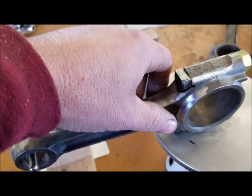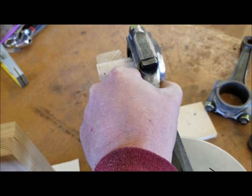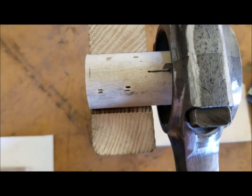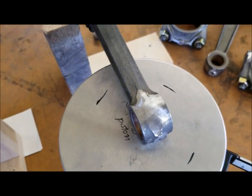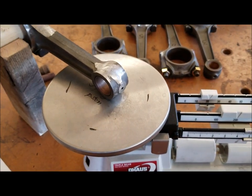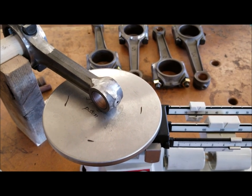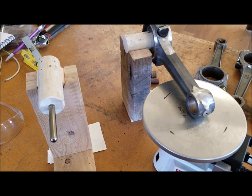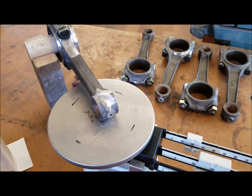When I go to switch this, I bring it over and get it to where it's pivoting just on the razor blade, then set it on the scale and dial it in. I started with the small ends, got those close with a little grinding on each end. Then I measured the big end and did a little more grinding to get those close. Then I'd go back and check the small end again, then the big end — working back and forth until it was as close as I could possibly get.